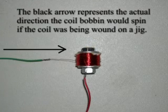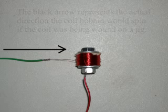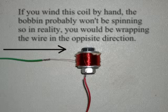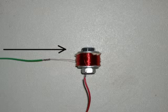Let's get down to the mojo of this video now. I didn't want to waste your time showing you this coil being wound on YouTube — most of you that do these types of projects have probably wound enough coils already. The concept is pretty simple: we're making an electric reference magnet. You've got to use color-coded wire on this thing; if you don't, it's useless. The key is twofold: first, the direction the wire is wound in; second, that you know where the negative and positive hook up to it. Take a second and study the coil in this photo. The poles are pointing up and down in a vertical position. Look below the coil and you're going to see a red wire — that's your positive wire and it hooks to the center conductor, or the beginning of the winding of the coil, right up next to the threads.